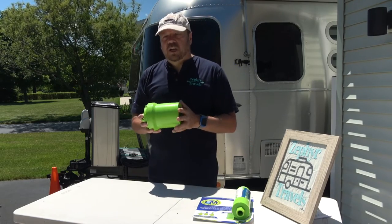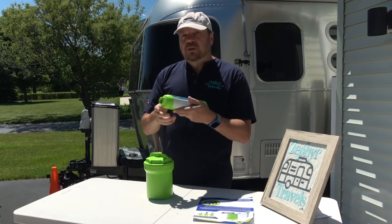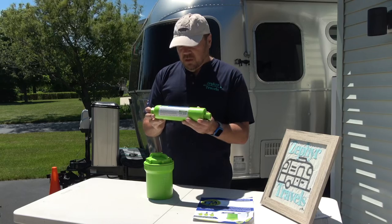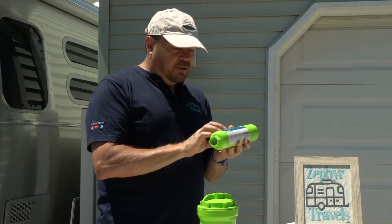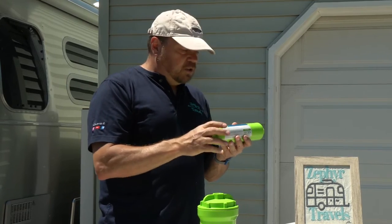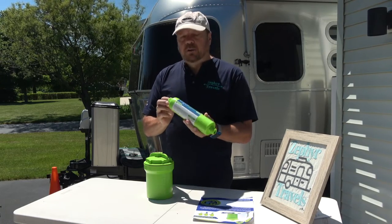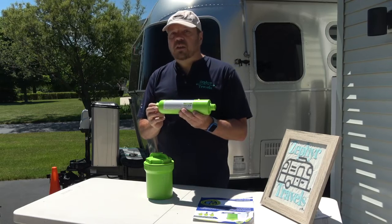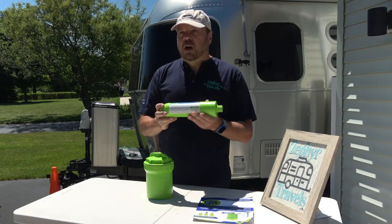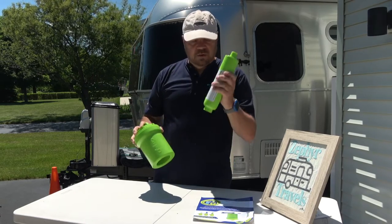So why do you need a two-stage water filtration system? A lot of people just buy one carbon filter and think that's enough. The problem is that a carbon filter alone is a 100-micron filter — it will capture dirt and sand, but all that debris will also clog the carbon filter and make it less effective. Using this pre-filter ahead of it pulls out the heavy stuff so your carbon filter works better.